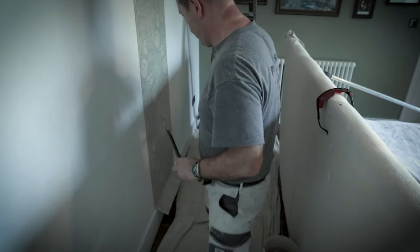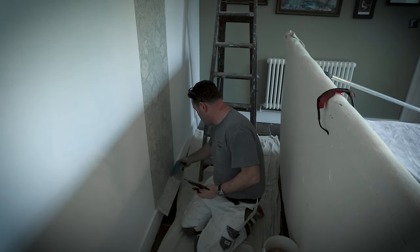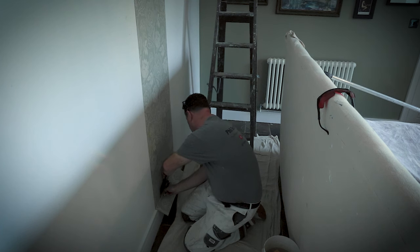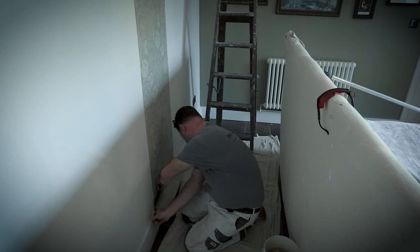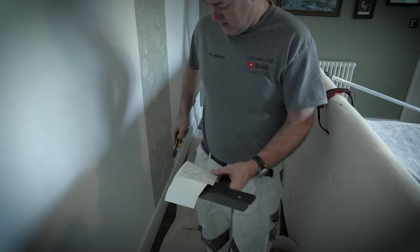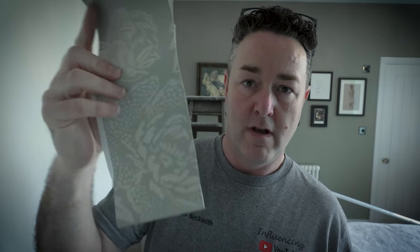I'm just cutting the bottom now — get it all the way in. Keep your blade in place and move the spatula that you cut with. The bottom will probably have a little bit more than two inches coming off because I allowed a bit of extra when cutting lengths. I want to mention: get out of the habit of using a spatula for cutting because the thickness of the spatula is thicker than the blade, and when you come to doing neat cuts on these sorts of papers the sharper the cut the better. A spatula leaves a little bit of an overlap because you're not cutting tight enough.